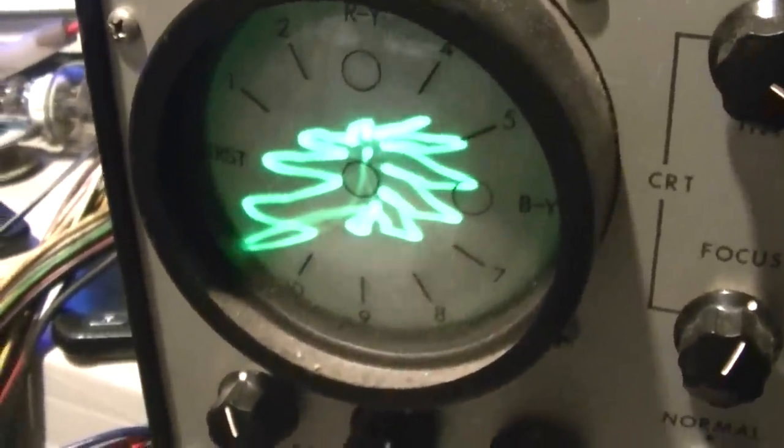I want to get the VG91 and see what this looks like. I can't believe it's that bad. This is interesting. Using the VG91 on multi-burst, that looks okay. Might have a little bit of an IF alignment problem that's a little bit limited here. This looks decent. So it's probably not a bandpass issue, but this is the EIA. This is what I was talking about, but it doesn't look quite right. The green and light blue, right? We were looking at that. But you go to color bars, there's no red and no green.